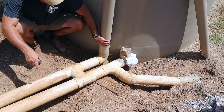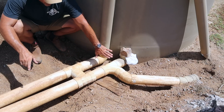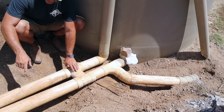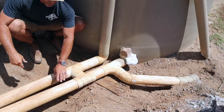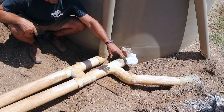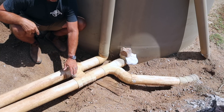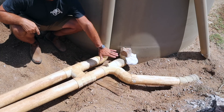I'll still use the existing pipes because these are just friction fit anyway, so it's not a huge deal. Basically I'm going to recreate this, and a little explanation if you were wondering why these connect: these two big pipes come from two separate runs of my gutters — it's just a volume thing, more pipe for more volume of water. The reason these are connected is because when I drain the water from these tanks occasionally, like in the winter months during hard freezes, I want to be able to drain both sides of the pipe.